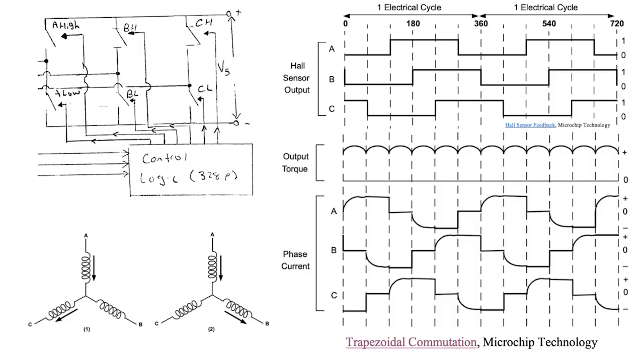As mentioned earlier, the main benefit of BLDC motors is electronic commutation, as opposed to traditional commutation with brushes. There are 3 control schemes for electronic commutation. Trapezoidal is what I'm using today, so it's the only one I'll talk about. In the trapezoidal control scheme, the MOSFET bridge must switch in a specific sequence determined by the positions of the rotor's magnet pairs and the stator's windings.